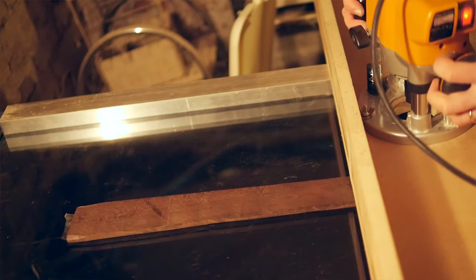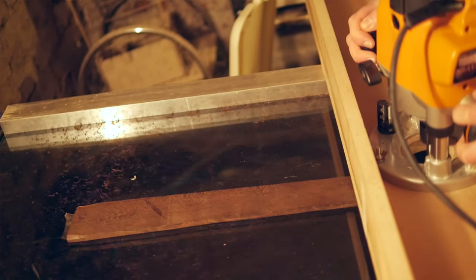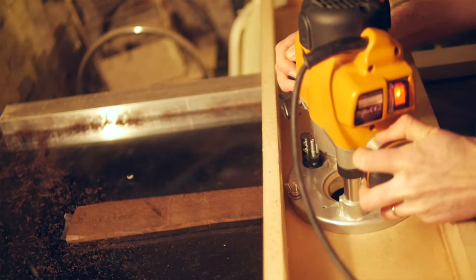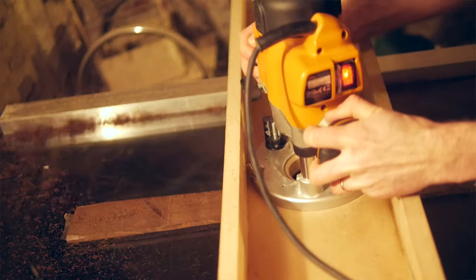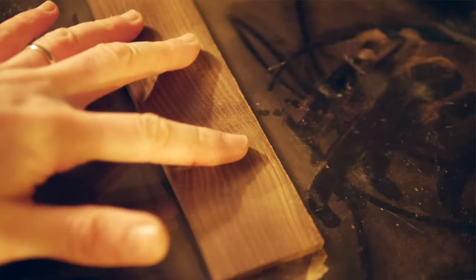Since the neck will be nice and flat still at this point, it should give me a nice solid base and reduce the amount that the fretboard wants to flex whilst the slots are sawed. Firstly though, I sanded and then used the router to take the fretboard to the required depth. I haven't captured it very well here, but this dull looking piece of wood really came alive when some material had been removed. It looks absolutely stunning in real life.